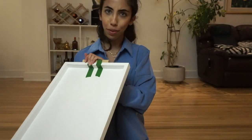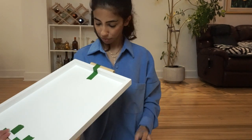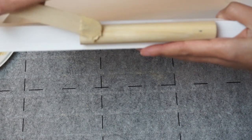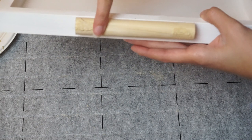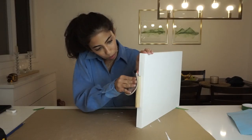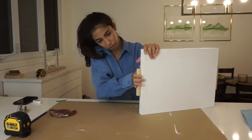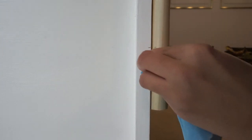I think I can take the tape off now because the nails are holding it in place. I have some wood filler and I'm going to use that to fill in the little holes that the nail gun created. Then I'll just take some sandpaper and sand away the excess wood filler. And the last thing I want to do is clean off the markings I had for the center of the dowel and the center of the tray — and then we're done.